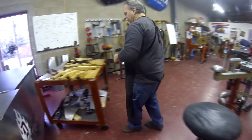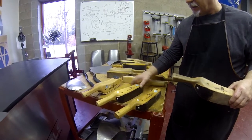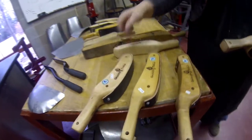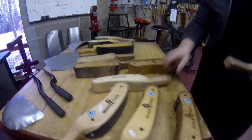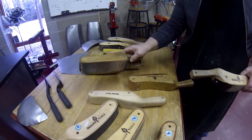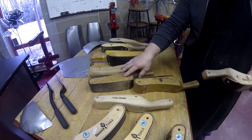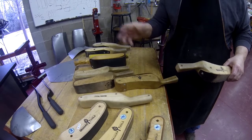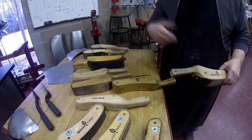As we see here on the table, the three or four most commonly found slappers in today's market are a flat face slapper, one with a medium or low crown, one with a high crown, and a full radius type slapper. Those are the most common. Over the years we've also progressed to weighted slappers that have additional weight installed — in this particular case another half pound — giving the slapper a little bit more versatility, particularly on thicker gauge metals and in some cases even on thin gauge metals, for turning an edge or a surface.